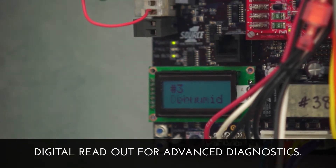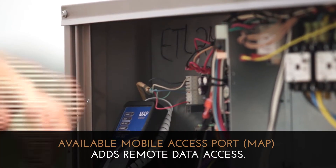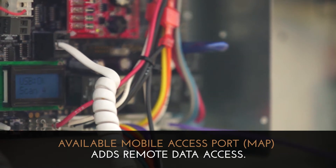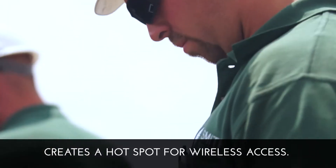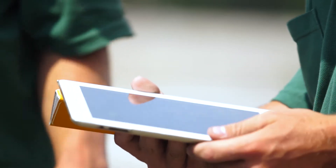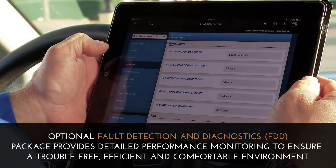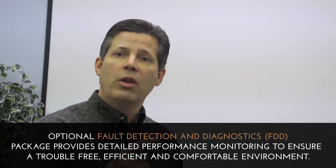One of the features we've added is what we call a map gateway that we can plug into the control, which then turns your unit into a wireless hotspot. Everybody knows what that is — you can now pull out your smart device, your tablet or iPhone, and instead of looking at just an LCD screen, you're looking at your iPad, tying into it through a basic internet browser to do all your commissioning, setup, and programming right from your smart device. And if you've got a number of units on the roof all tied together through the building automation system, you only need one wireless gateway to gain access to all of the units on the roof.